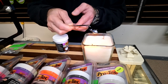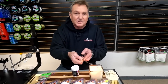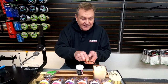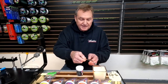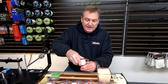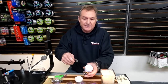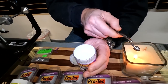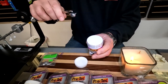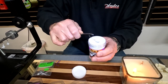If I was going to do a lot of this, I wouldn't be doing it here in the shop — I'd be in my garage with the doors open and a little ventilation. It's not bad, but when you're working with paint and lead, you want to be careful. So we'll heat that up good. I've shaken this and gotten a lot of air in it — you can see how powdery that is. Now the trick here is to do it quickly, so we're just going to dip it in and shake it off right away.